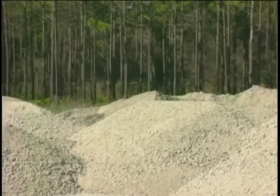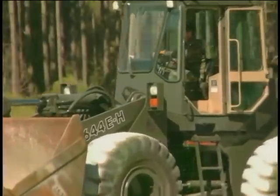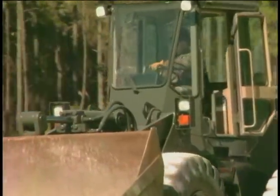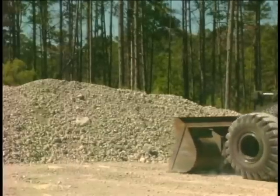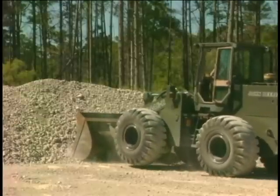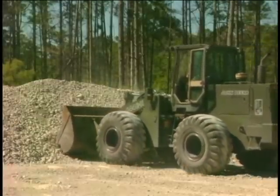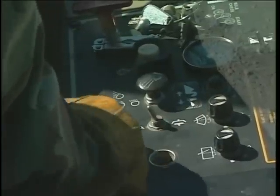If the material to be dug is virgin earth or medium to hard packed material, you may have to set the front end loader up a little differently to maximize both the engine power and hydraulics. Upon entering hard packed material, the bucket may actually stick in the material. The front end loader with the transmission engaged cannot produce enough power to drive the hydraulic pump fast enough to lift the bucket. To overcome this situation, most loaders have a clutch cutout feature.